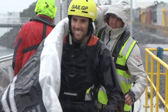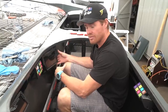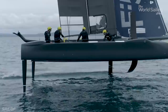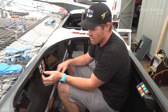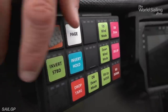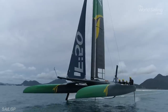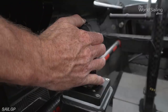This is the flight controller station — this is where Jason Waterhouse sits. Whether he wants to see the rudder rakes, the daggerboard rakes, or how we're doing on target speeds, he's got all sorts of different pages of information here. Right here he's got his control panel and his joystick. He can change all different modes — how fast the daggerboards fire down, how quickly they come up, how quickly the rudders swap from tack to tack. You'll also notice a little patch on the buttons — this is a kind of braille. When he needs to hit this button, he actually can't look at it; he's doing another function, trying to fly the boat. The joystick is what the flight controller uses to fly the boat in manoeuvres — he can rake the different daggerboards around the boat and also has control over the rudders with the top of the joystick.